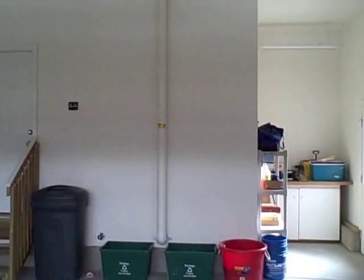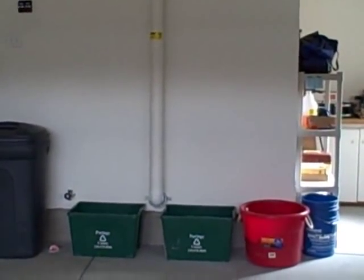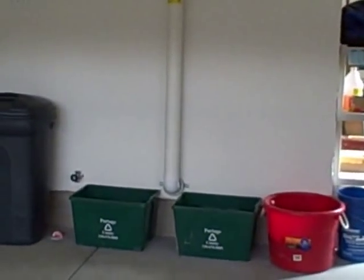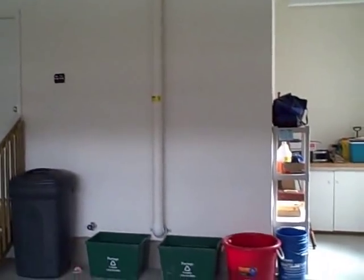Next, we'll take you to the garage. Here we are in the garage, and right here you can see the riser exits the basement, comes through the band joists and into the garage interior. It runs vertically where it penetrates the ceiling and goes into the attic space. There's actually a finished living space just on the other side of this wall. We didn't have a whole lot of options on where to locate our suction point in the basement because of the living space above the garage.